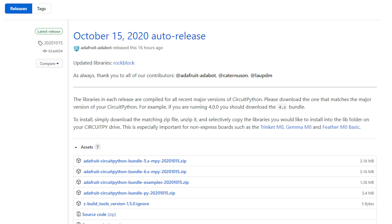CircuitPython is a programming language that simplifies experimenting with small microcontroller boards like the one we are messing with today. You can write code in any text editor and go back and edit that code really easily. So our demo script will be using CircuitPython. This was all set up so that your computer can read what's going on with these components. Now we can actually read the FRAM breakout board with a handy little script that Adafruit supplies on their website, slightly edited for this demo — I'll put the description down below so you can copy and paste it for yourself. The script will read the value saved on the board into your CMD as an output.